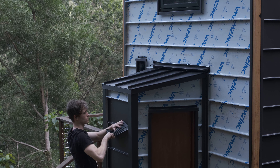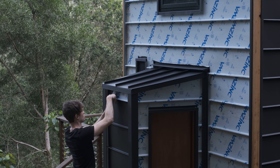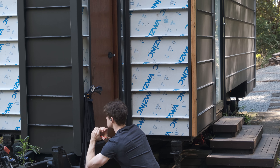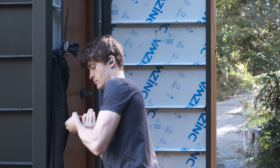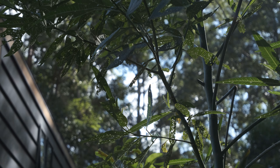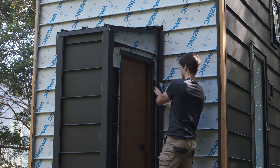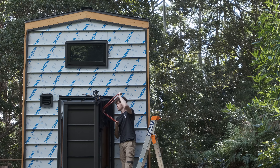One of the most satisfying things about getting these panels up and folded is getting to peel the plastic off each one and slowly seeing the finished wall appear. I can't get my dedicated folding tool into the panels by the doors, so I'm using my 90 degree bending pliers to make a single lock on the standing seam. A single lock visually looks a bit larger than if the seam was folded twice. If someone who actually does this for a living is watching and knows a way I can get a double lock on these panels without buying another expensive tool, I'd love it if you left a comment.